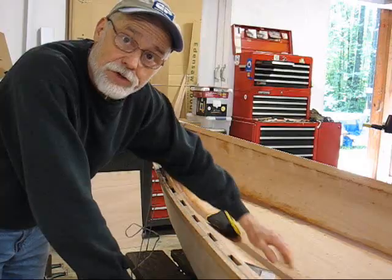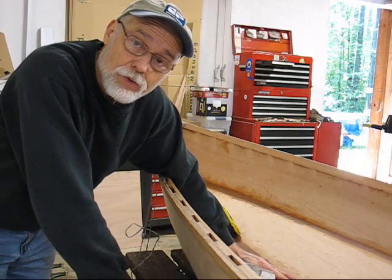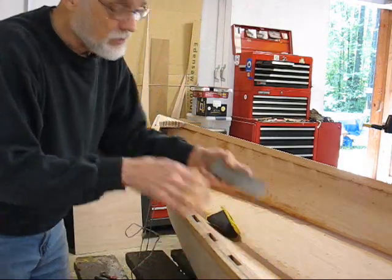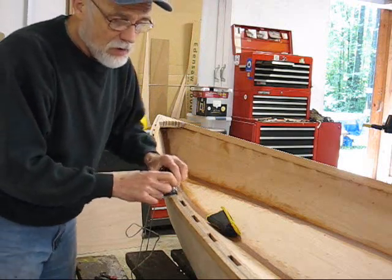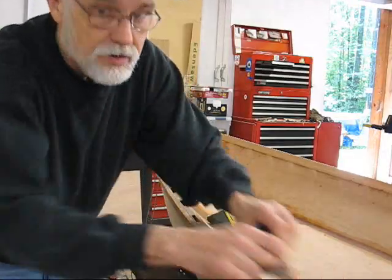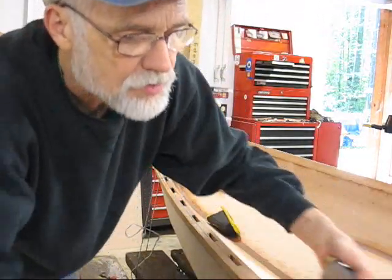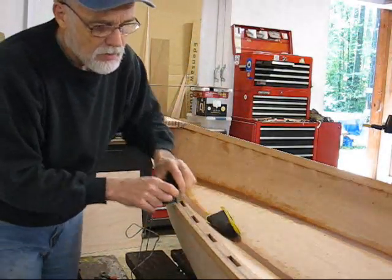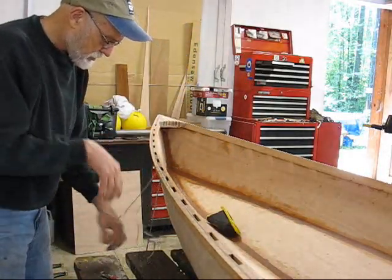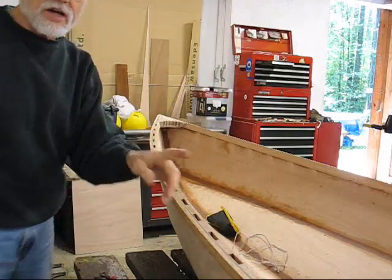While I'm waiting another day for the fillets to cure before the final sanding and glass tape, I've taken out my little low angle plane. Just set it out where you're getting enough — take it slow and easy and just move it along. I've got the spots here where it's tied down, so move the string out of the way and re-tie it in the middle.